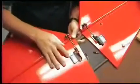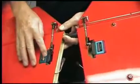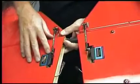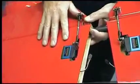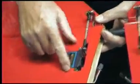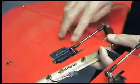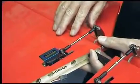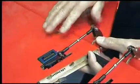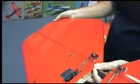You can see where I've cut in the BLS 152 Futabas. The problem was you can't quite get these fully inside the stabilizer. There's not enough room. I have built in across here some sub ribs so that the servo can screw into that. A little bit of drawing up just to make sure everything is going to go in nice and kosher, but it's a direct drive. Really nice. One servo takes care of it. It's quite a big surface. If you ever intend to do this, make sure you get a good quality servo with a lot of power.